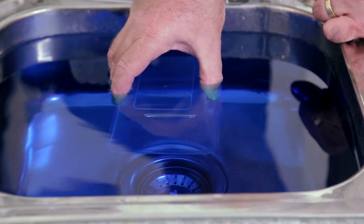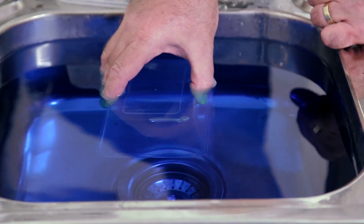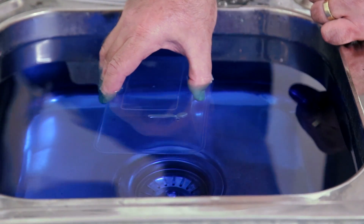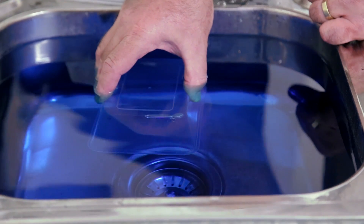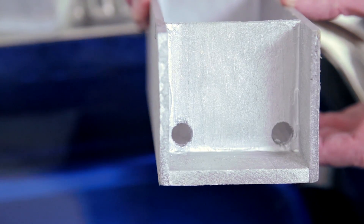And look there — just about no miss. The code does allow us to apply paint if there's a miss, but only on small areas like this. So put the hole as close to the top as possible, and the more holes the better.